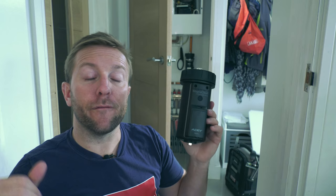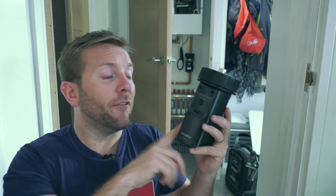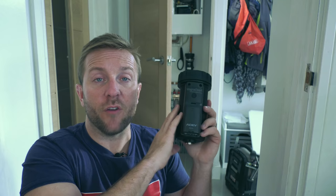So what does this actually do? The MagnaClean Pro 3 Sense allows us to know how much magnetite the magnet has caught without having to take the lid off. But we've gone a little bit further than that. The game-changing bit is that I can install this, and if I get a phone call from these guys in six months' time saying there might be a problem, I can go onto my Pro app from the van — say 30 or 40 miles away — and I'll be able to see how much magnetite this magnet has gathered. If I've done a job on a heating system, two or three months later I can have a look and see if I need to add any more inhibitor. We can use these as a dosing pot, just like with other MagnaCleans as well.